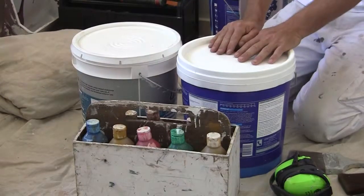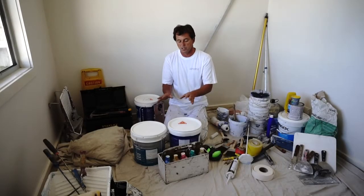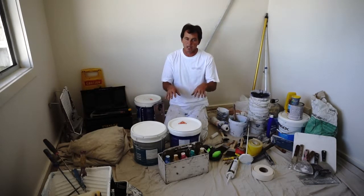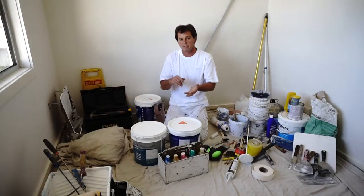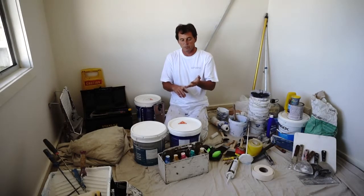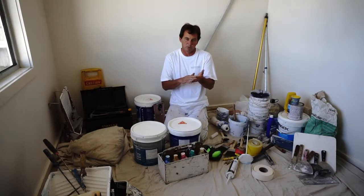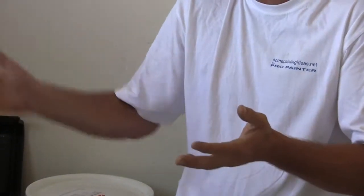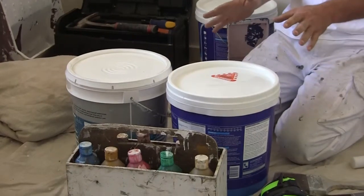With priming, super important. You can buy the best paint out there — that's not a problem — but don't always be convinced that the most expensive paint is necessarily the best. Don't get swayed by advertising that they're washable or this or that. The general rule of thumb is flat paints are not very washable. There is a coarse pigment in there, and when you wash it you might get it shiny. Sure you might be able to wipe it over, but it's certainly not washable in the true sense. I call washable getting a rag and giving the wall a good wash. I don't believe that there are many flat paints that are truly washable.